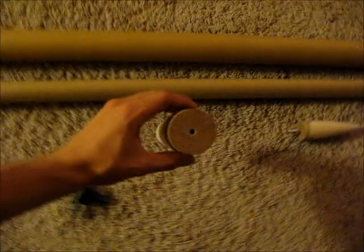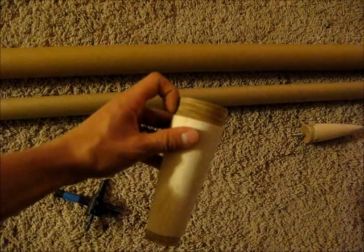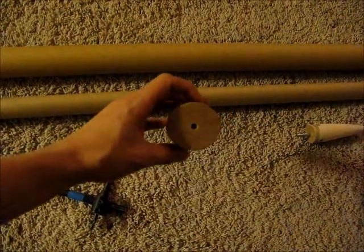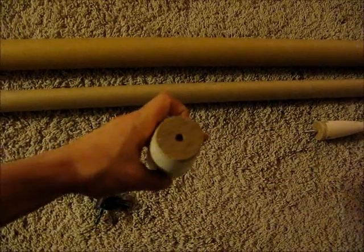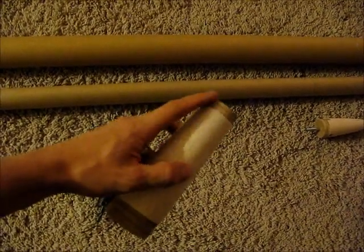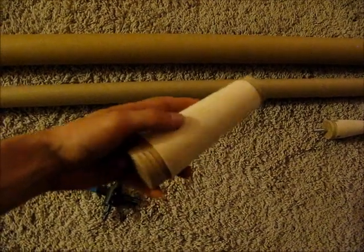And what I did is I got some thin lightweight plywood, and put 4 sections of the 1/4 inch there, cut out some circles, glued them together. So that fits in the one tube. Did the same thing on this side. And after I got those two on there, I kind of hogged the bulk of the material away with the belt sander, just spinning it around.